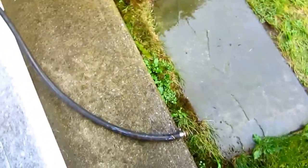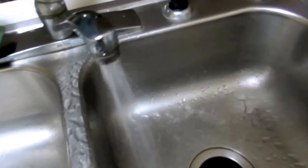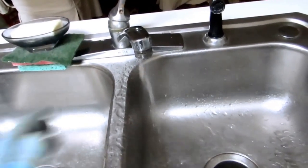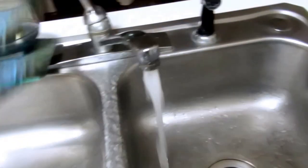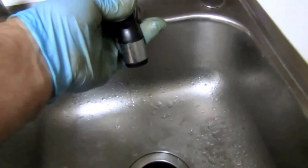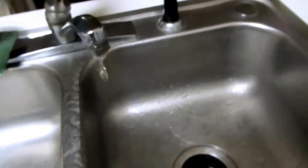All the water is out of the tank now. I shut the valve off down below, I'm going to open up the cold. Compressed air is going to pressurize this tank — don't forget I only got 60 pounds on that so it's not going to blow anything up. Once I get pressure throughout the system, I'll go around and open up hot and cold and blow all the lines out. Next thing is to go around and basically open up the faucets — you want to blow hot and cold out of everything. I'll go around and do this to every faucet a couple of times so there's no more flow of any kind of water at all. It's going to take a while.